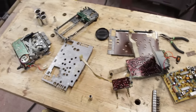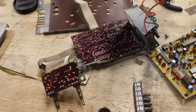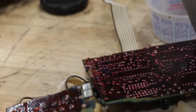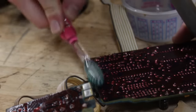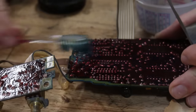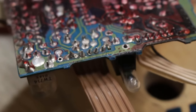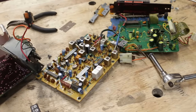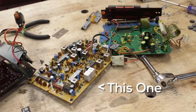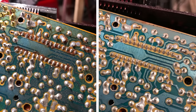Almost all of these boards have what's called a conformal coating on them. It's just a thin film that's meant to act as a protective layer for the components, which on the amplifier board is red, as you can probably tell. But I noticed that even with this protective layer, there's still a bit of heavy corrosion happening here. Is that what's causing the audio issue? I don't know, but it's probably still not good. For cleaning electronics, a lot of people's go-to is isopropyl alcohol. It does a pretty good job of getting rid of contamination, and it also evaporates pretty quickly, meaning it's not going to stick around and cause problems. So after a lot of scrubbing, we are left with this — one very clean group of solder joints. That was the only corrosion I found on the amp board, and the only other corrosion I found on any of the other boards was on this one here.